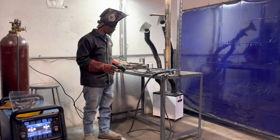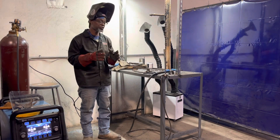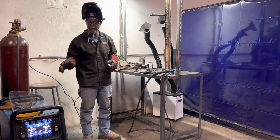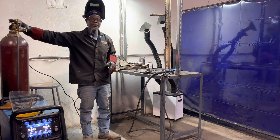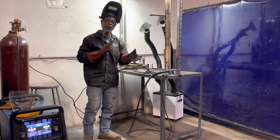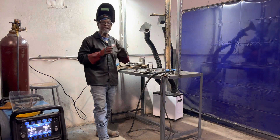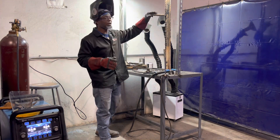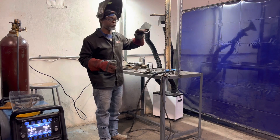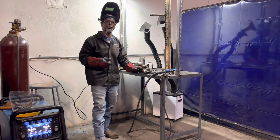Today I really think it was the stick out — too close to the metal — that caused the student some issues. But he's been running good beads. We fell back in, tried a couple of things, checked the machine, the rollers, and the gas — the gas wasn't set up high enough either, so we turned it up. Check everything before you dive into it. Put a scrap piece of plate up and run a couple of beads to make sure the machine is set right before you start your test.